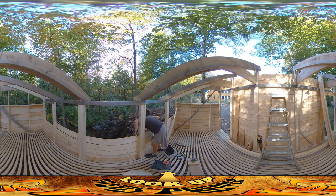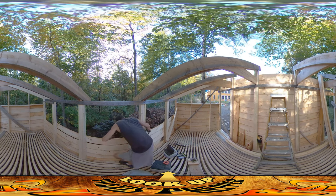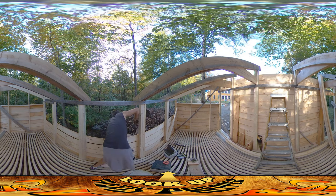This is a really warped board. So what I'm going to do, because it's a really warped board, is pull this one up higher here. The gap in this area is just right, so I'm going to nail these in. Then I'm going to pull that nail and I guess I will have to really force it down. I'm going to come around to this side and try to force it down as I go. I'll pull this nail that I just put in — it's backed out and now I can use the leverage of the long board to kind of force it.